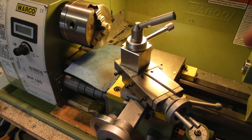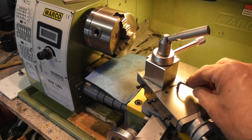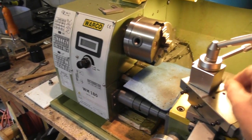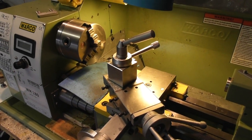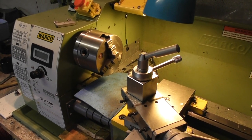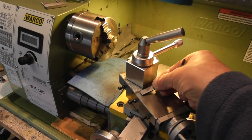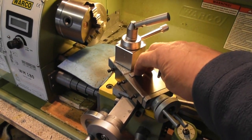Now I've drilled two holes in the top, so I'll get my allen key in, turn it, move it, lock it up. All I've done is disassembled it, lined it up, marked out where the two holes are going to go because of the plate underneath. When I'm not altering anything and I'm cutting, I just put my little cover over the top and it stops any swarf going in them holes.